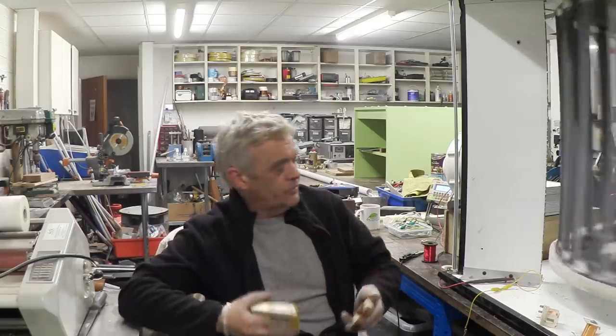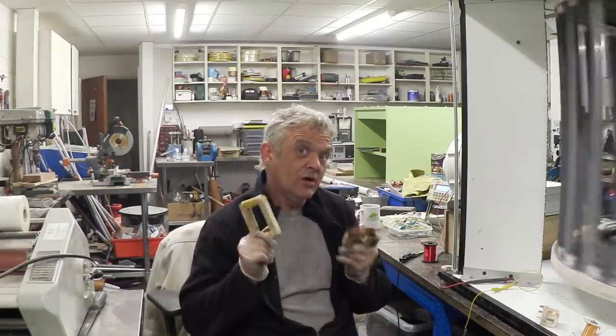So I guess it's just a choice that you want to make, whether you use the primary or the secondary. Do you want 20 volts out of it, or do you want 2 volts out of it? And that would be the choice you make. And it makes sense, really, because these are obviously thicker wires and there's less of them, so the resistance is lower, ergo the amps is up, but because there's less wires, the volts are down. So it didn't seem to matter much which one I used. It was only a choice of whether I wanted high volts or high amps. And that seemed to be the choice that mattered.